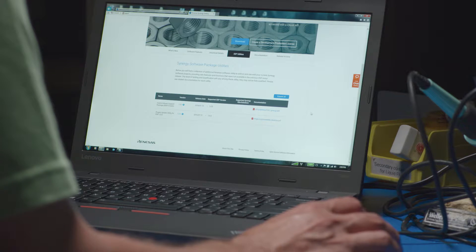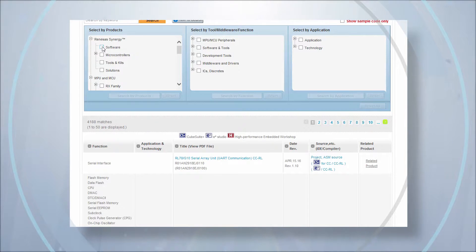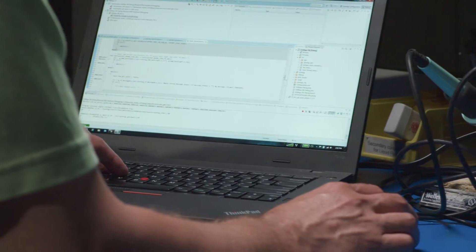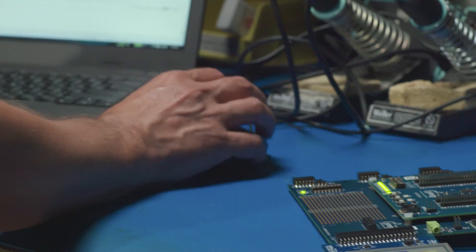The SK dev kit is very reasonably priced — actually both of them. The DK dev kit takes it to the next level in terms of connectability and evaluating the features of the processor. They're both reasonably priced, so there wasn't a big expense to get those dev kits, and then you're off to the races. You can download demo examples for various features of the software platform and piece them together — take the file system example, combine it with the web server example, and quickly have a web server based on either USB flash or eMMC flash, building toward your actual product design.